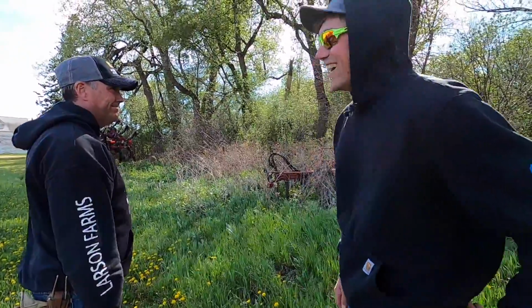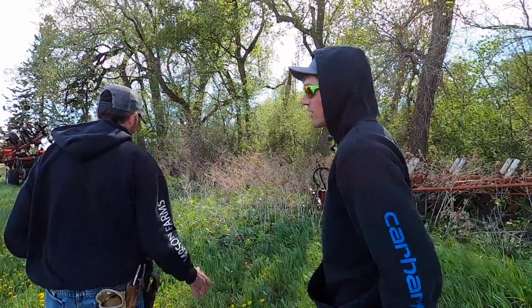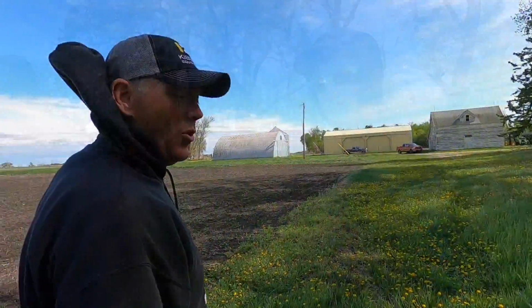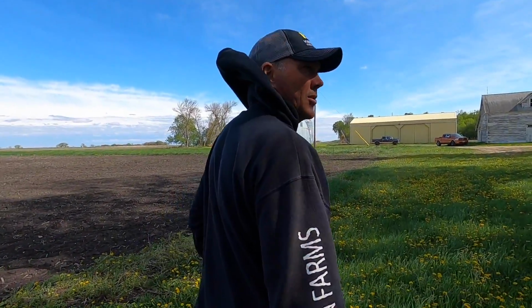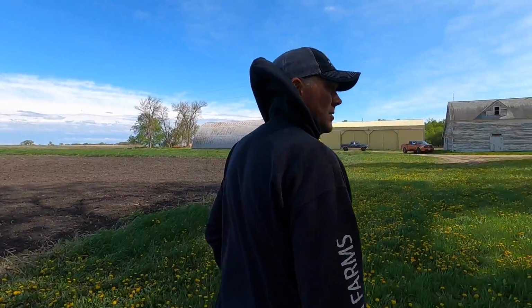They did like, what, 80 acres? And boy did we pay for it that fall because it was so soft out there and muddy. Made for a good YouTube video, but that was about it. If you moldboard plow the next spring, if you have a wet spring, it's so soft out there because the plows literally turn it over, do a good job coverage, and then it gets like a soup bowl. So the rippers do a lot better job. You don't have a sinking issue.